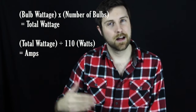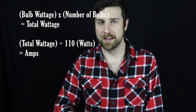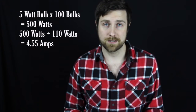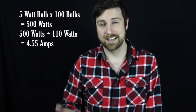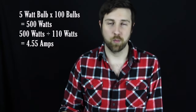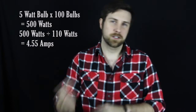That way you can say, I have 5 amps that I'm going to be pulling — I'm going to be putting that on a 7 amp wire, so I'll be fine. I can run that entire thing and I won't have to cut it up. So let's do a quick example. If you have a 5 watt bulb and you're running 100 bulbs, that's 500 watts. You take those 500 watts and divide it by 110, and that will say that you have 4.55 amps that you're pulling. So if you're running a 10 amp wire, you can definitely light 100 5-watt bulbs. The same formula works in reverse — if you want to start with the number of amps you have and figure out how many bulbs you can put on that light string, it's just the same thing flipped backwards. Check that out in the description.